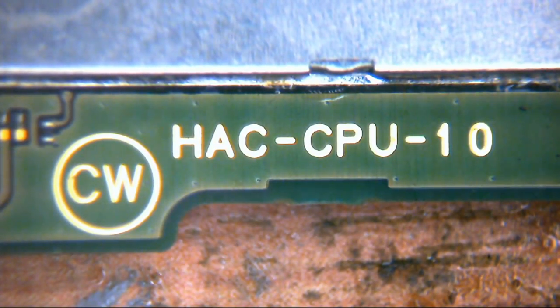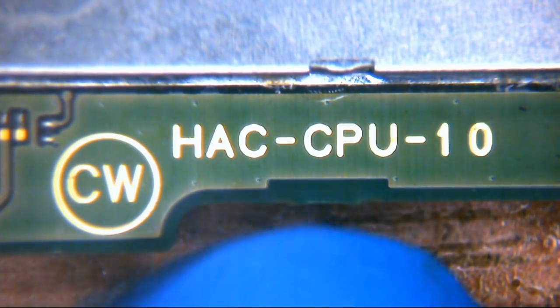So like I said, this particular machine is completely dead. If you plug a charged battery into it, it's completely dead. It doesn't do anything at all. So we know it's not the battery, because if you plug a good battery in, it's still dead. Regardless as to whether you have it on the charger or not, it's dead and doesn't do anything. So that tells us that we have a problem on this board here.